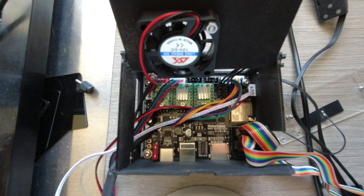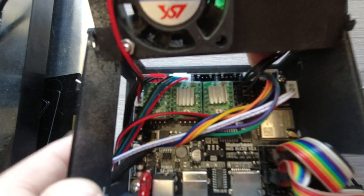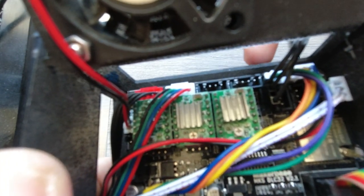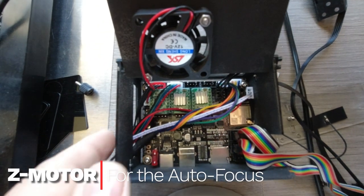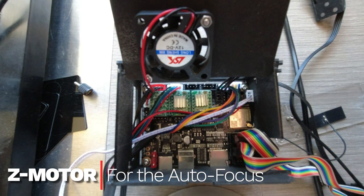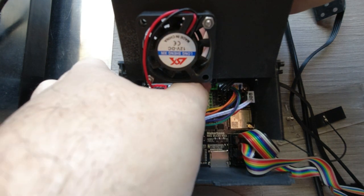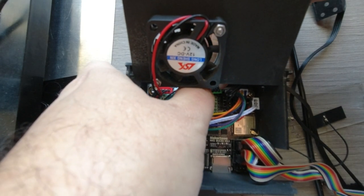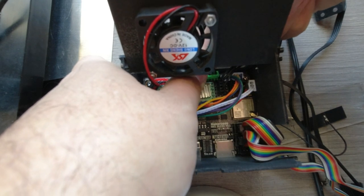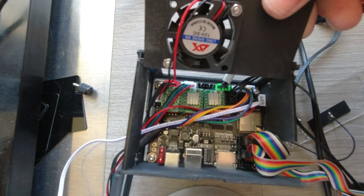The other terminal's color can be green or white — that varies — but that's what you want to install there. Please be aware those two little guides go right into the little holes; there are little lines in here. Don't force it — it's important not to force the cables in. Connect this cable, put it in there, and push it once you know it's completely in the right position; you don't want to bend pins. There we go — the motor cable is installed.